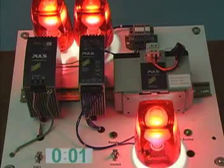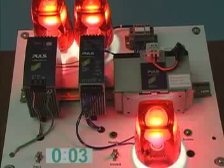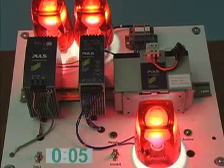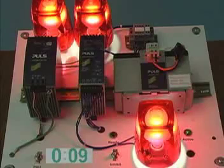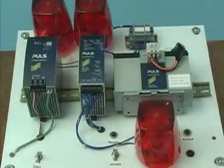Because our dial was set at 10 seconds, the DC UPS will shut down after this time has expired. At this point, the diagnostic LED shows that the buffer time has expired.